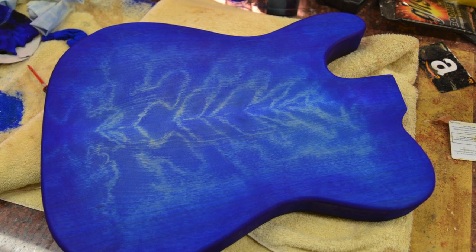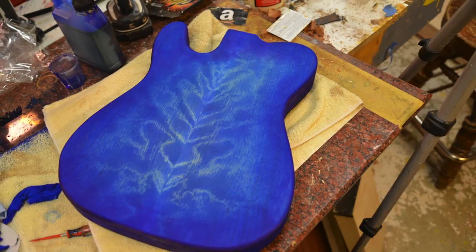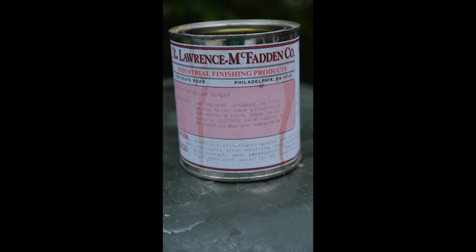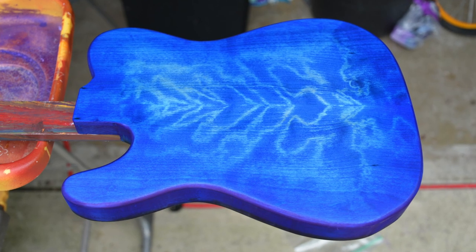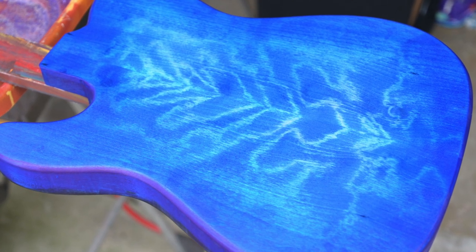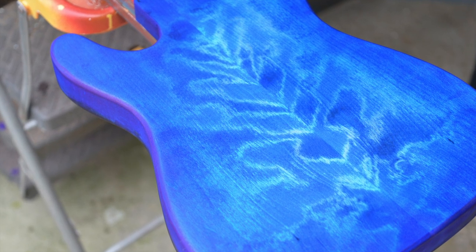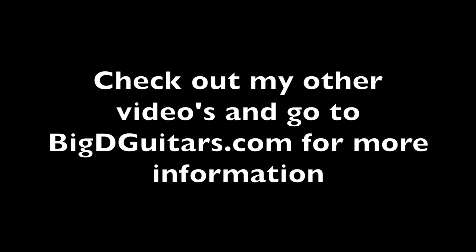That is the blue dye with the blue edge and sanded back in the middle. This is after 24 hours — all the dye has dried. I am going to take this outside and use some McFadden sanding sealer, put a couple coats on, and you get to see the really beautiful effect that this has now. Birch is a little blotchy at times — there is some blotching on the top and the bottom — but really happy with the way this turned out. Nice big flames, dye looks pretty good, really faded in nicely, beautiful coloring. Thanks for watching guys, check out my new website and see you in the next vid.